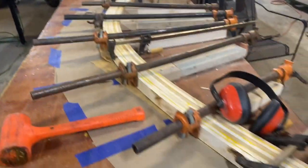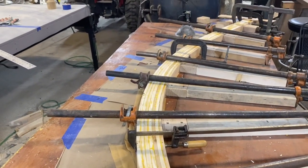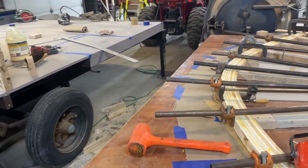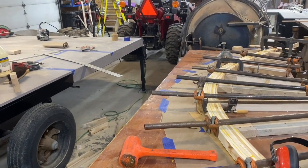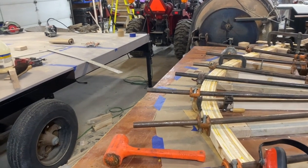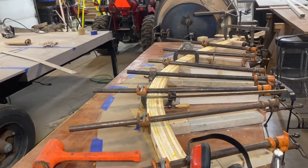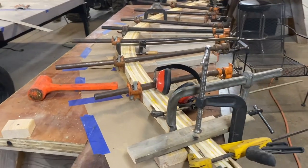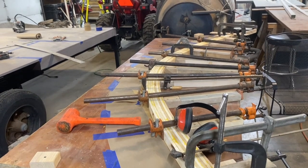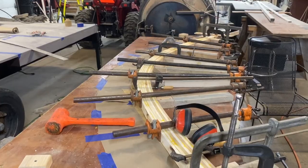And this is the last one glued up, except for, like I said, I gotta build those plates, and they're gonna be made out of treated wood, because I'm not sure if I'll just paint them, leave them treated and paint them, instead of trying to wrap it with metal at this arc. That would be a complete pain to wrap metal at this arc, but we'll see how it goes. They're gonna be treated. They'll be outside the insulation envelope, basically your fascia board.